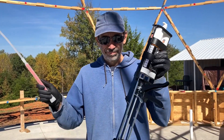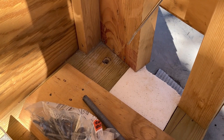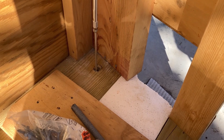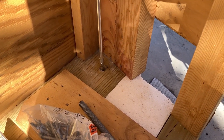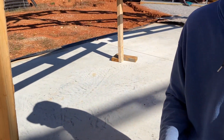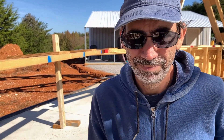Those are the tools, let's get started. Yesterday we already drilled all the holes, cleaned them out and brushed them. So today we'll just give them a final quick blow, make sure they're nice and clean — they're super clean — and then they're ready for the epoxy.